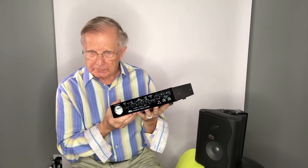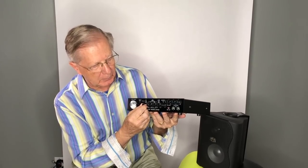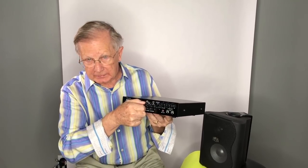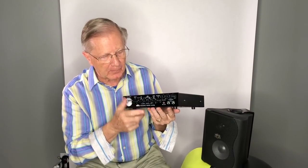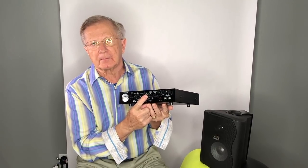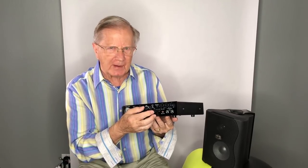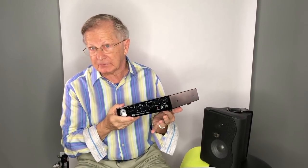This is a parametric receive audio system, and there are two components to it. First of all, this has three equalizers in it. We set the lower limit and the upper limits. The lower limit is sitting at 160 Hz, plus or minus 15 dB, and the upper limit is at 6,000, and you can either cut or boost that by 12. However, the most important thing is the midrange, and instead of doing a fixed equalizer there, it's parametric, meaning you can change the parameters of that filter. As we learned from the Bell Lab studies, 2.5k–3k right in there is very important for articulation, so you can understand the difference of an F and an S, a P or a B.